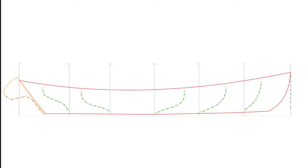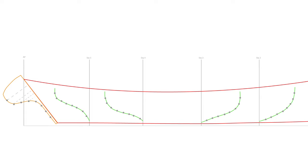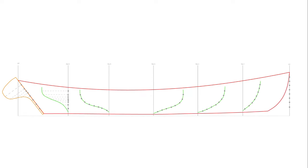Now we're going to project each of those points to the corresponding lines in the profile view. First we'll start with the transom and add some dashed lines to represent the projection lines. Now each point will be projected along the projection lines to the transom as seen in the profile view. We then repeat this process for the fifth station line, and again along those projection lines we project the points. We then repeat this projection process for all the remaining station lines. In practice, all that you've done at this point is divided up all the mold curves and transferred those points to the physical molds.